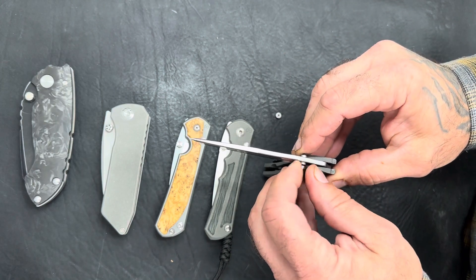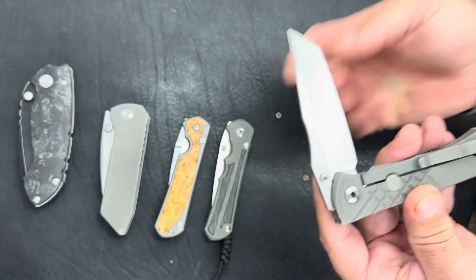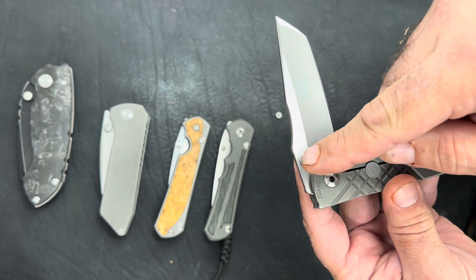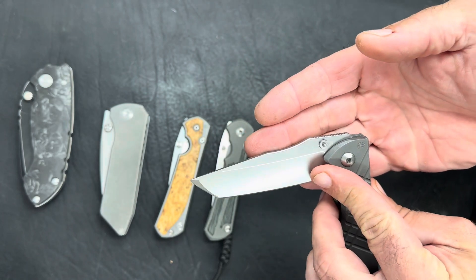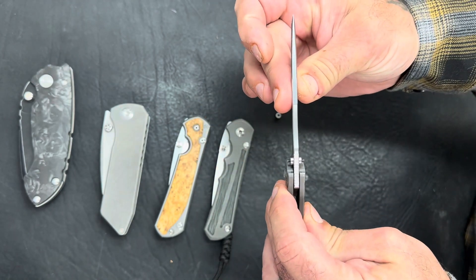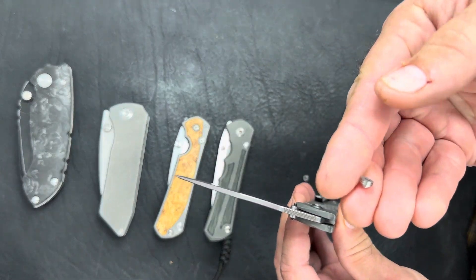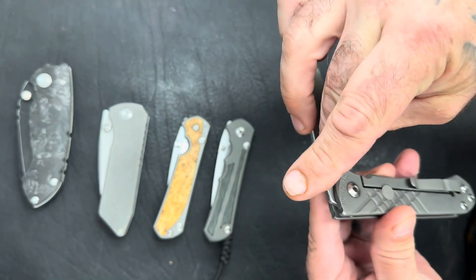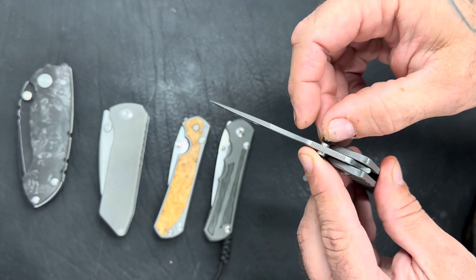Basically what I did was come in with an end mill, held the pin transversely with a 5C collet and collet closer, milled off the top of it, found center, drilled and tapped through it at 2-56. So this little stud I made is essentially the stock thumb stud without those O-ring grooves on top — it's still going to hit this frame in the exact same spot as stock. Then I took these Ti connector thumb studs and faced them down about 50 thou, so they're about 130 thou thick — close to the same height as the stock ones, but with a little more area and traction.